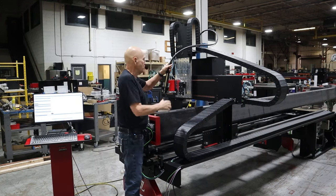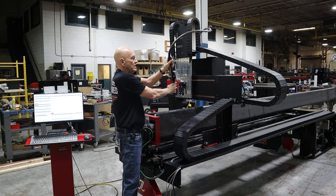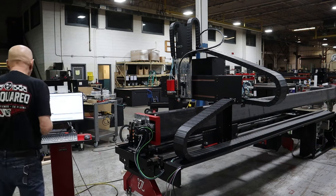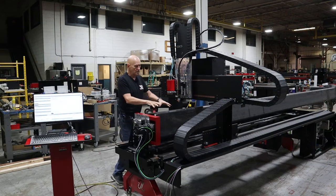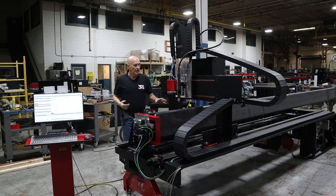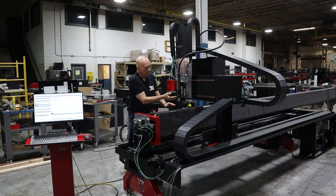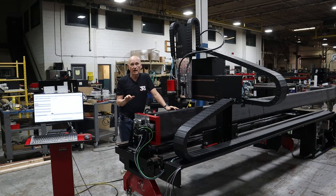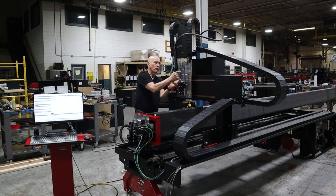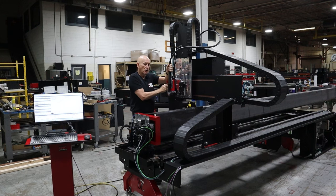To emulate a beamline machine, the torch has to be able to turn completely sideways and tilt in and out. Walking behind the machine, you can see that if we're going to turn the torch sideways to cut up and down this way, the bottom of the tooling plate won't allow it. So we have to make another axis on the front of the plate that will go up and down independently — in front of the marking system and the drill system — to allow us to turn sideways.